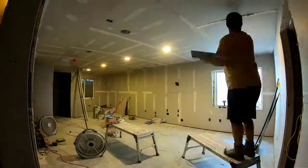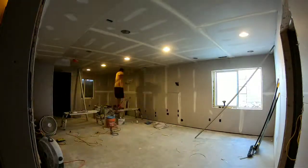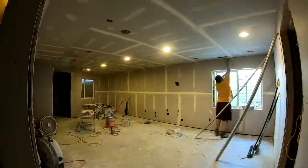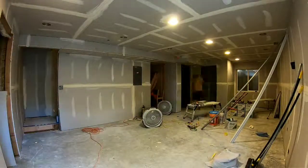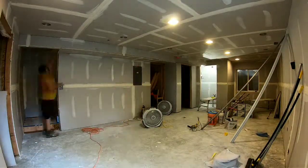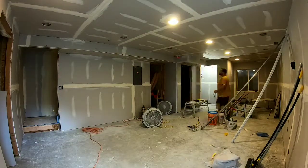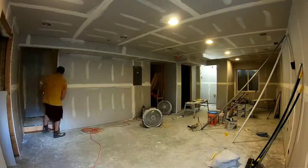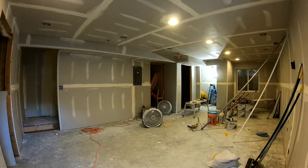After pre-fill you don't need to wait at all — you can move right into taping. I use a banjo for taping. Do your butt joints first, then tape your recessed joints. We're not going to tape inside corners yet. We're going to wait for that to dry and move on to the bead. If I were to take my tooling right into those recessed and butt joints, it's going to peel back and make a huge mess. So I can use that 30 minutes to an hour doing something else while the tape dries.